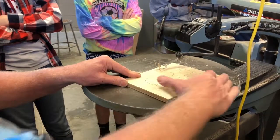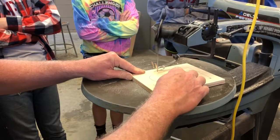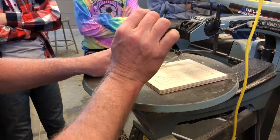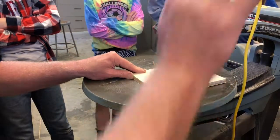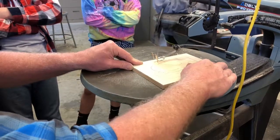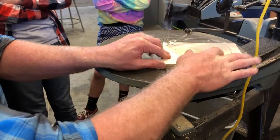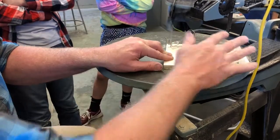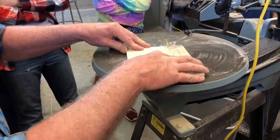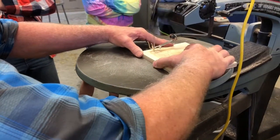Also notice: if I come off the line, I do not want to back up and recut, because then I'm going to have a saw curve in my whale puzzle. This down here is waves, this is sky — it's flexible. When I get done cutting we're going to take a sander and sand all the pencil marks, and you can't see that I missed the line. It's kind of like taking a math test where you write in whatever number you want and then erase the answer sheet. We do want the whale to look like a whale, but the waves and sky can be flexible.